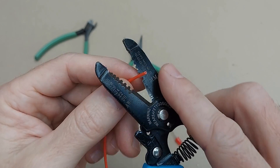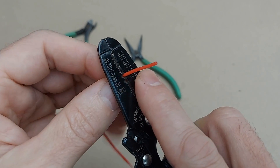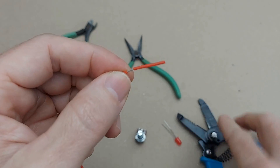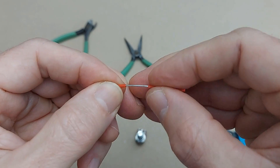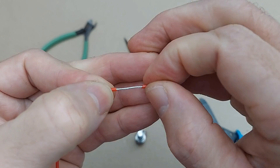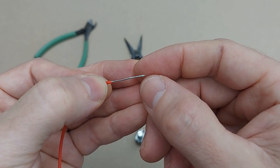I need to start by stripping some wire, and I'm going to strip a nice long section to give myself plenty to work on. I'm not going to pull the insulation all the way off — instead I'm going to only pull it most of the way off, and I'm going to use the insulation to twist and get all the strands together into one nice tightly wrapped rope.